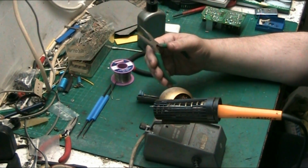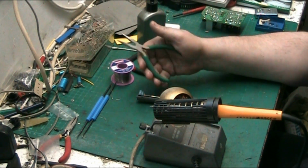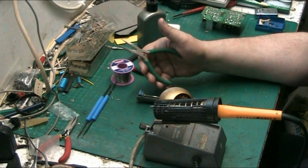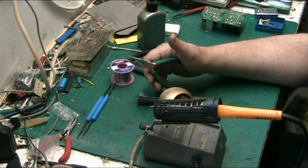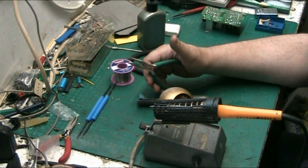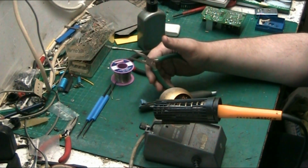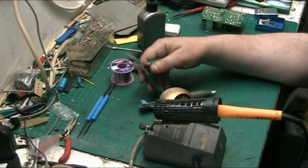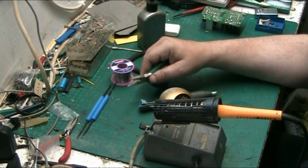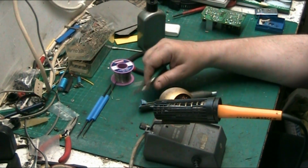Polite way of saying I'm old fashioned. Anyway, you'll need a pair of pliers. They're handy to lift resistor legs out and pull a transistor off after you've desoldered it. But make sure, before you pull a transistor or anything out, that it is desoldered properly. Otherwise, you'll lose a leg on your transistor, which might have been a good one, and then you could be in trouble.